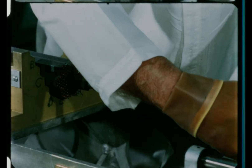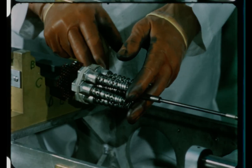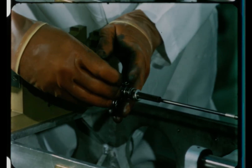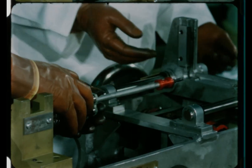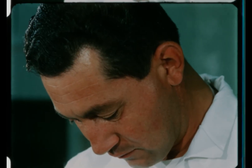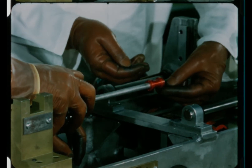To ensure firm seating of the elements against the support blocks, each element was fitted with a spring. The six springs in each cluster were held in compression by a common cluster plate assembly at one end and a screen cap assembly at the other. The screen inside the cap assembly served as a filter for the propellant.